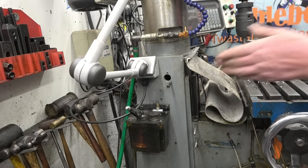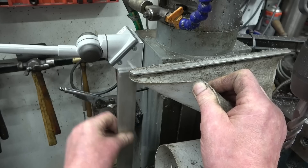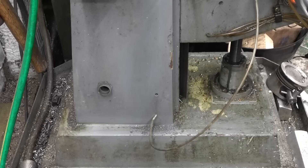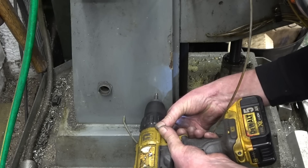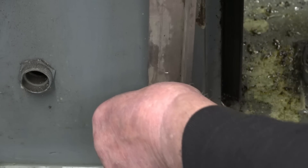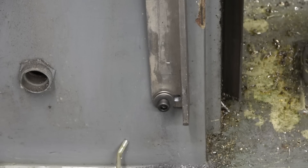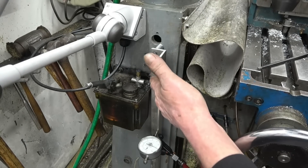I'll bring the camera in to show the problem I've got. It's got to be there to be straight up and down — it's lined in at an angle because of the side of the column. The bottom hole is slotted so we can use that to make sure the piece of aluminium is lying nice and square, then we're going to make a spacer to jack it out from the top. I've mounted a spring behind the top bolt so I can jack it in and out, and I've got a clock gauge on there to get that face running true.